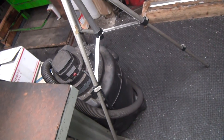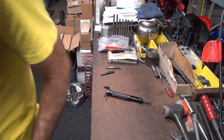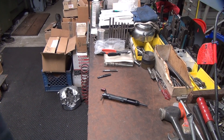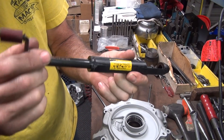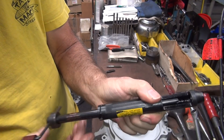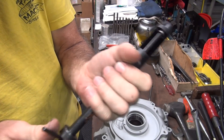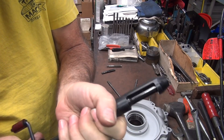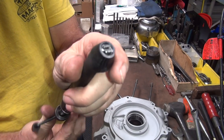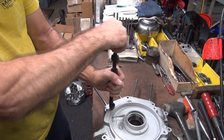So now this is the old tool for putting it in. There's a tang down there in the helicoil — it disengages the tang and pushes it in. The winder, which is this tool, compresses it and goes in the slot that turns it. If this is threaded in here, it sticks it in. So if you look up in there, it's threaded right there in the tip. You drop your helicoil in there, slide it in the hole, and you rotate it until it goes in and it comes out the other end. It compresses it so it goes into the hole easier — just line it up and wind your own end.